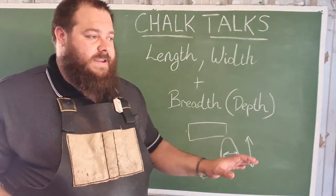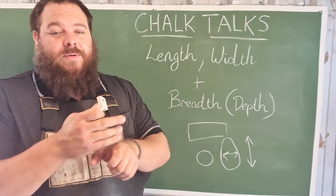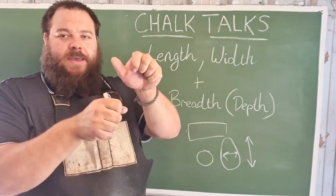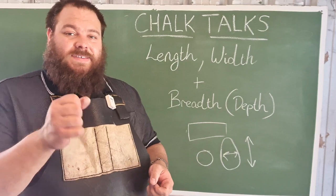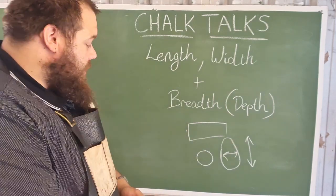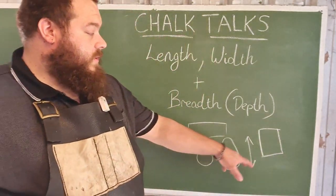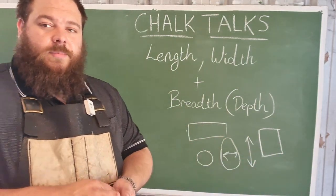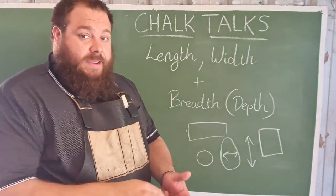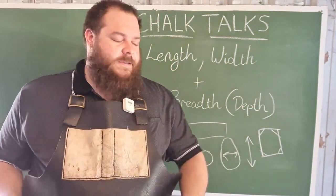This edge alignment is immediately negated by using perfectly round handles, because they don't give you any edge alignment — the handle could be upside down or sideways and you wouldn't know without looking. It also doesn't provide any connection to the knife; the handle can free-spin in your hand, whereas an ovate cross-section is going to stick in the hand in that groove between the thumb and forefinger. That said, a perfectly rectangular handle is going to be uncomfortable because the hand doesn't create right angles. That's when you go to octagonal — taking that corner off to provide extra roundness for the hand to fit comfortably.